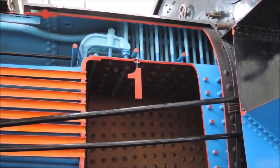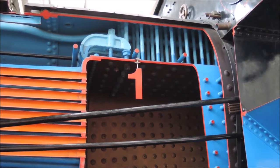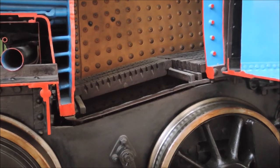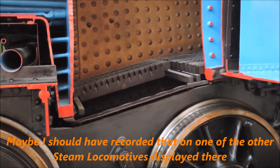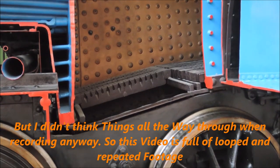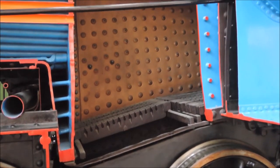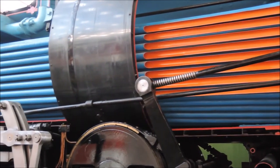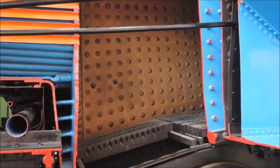With that being said, we can now start to look into the transition of coal and water into mechanical energy at the furnace, or firebox to use the locomotive-specific term — more precisely at the bottom where the grate is, where the coal burns, and below that grate at the ash pan where air flaps are hidden on this locomotive but well visible on the sides of others. These air flaps can be adjusted by the stoker to control the airflow into the fire. The grate itself is specifically designed for the fuel that burns, so you could not put wood or turf on this grate which is designed to burn coal. Temperatures in the firebox exceed 1000 degrees Celsius or 1832 degrees Fahrenheit, so everything and particularly the grate has to be heat resistant. Hence this grate here is made of cast iron, but others may consist of small tubes filled with boiler water and thus cooled from the inside.